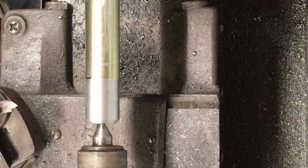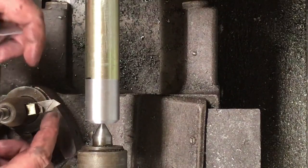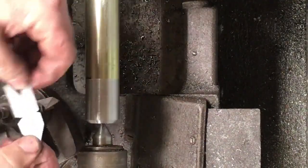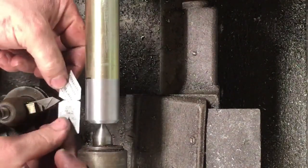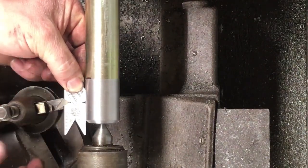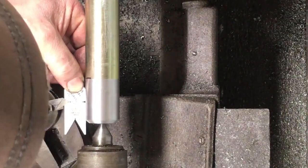So we've got our gearing set and we're getting ready to set our tool up. I've got a high speed steel tool ground to a 60 degree point with a slight radius dressed onto it. I'm going to take our center gauge and hold that up against the part, and that is what we're going to use to get the tool aligned correctly with the part so that we cut our threads correctly.